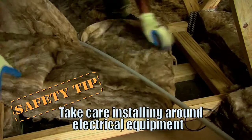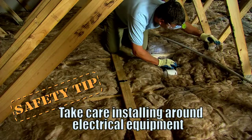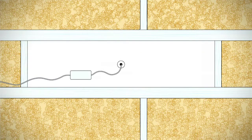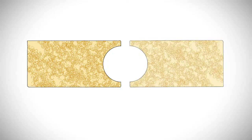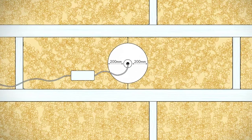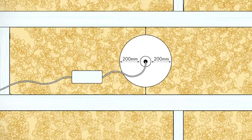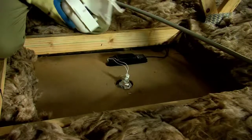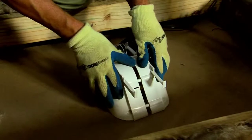You need to take a lot of care when installing earth wool around downlights, extractor fans, chimney elements and any other electrical equipment. For sealing downlights, cut a semi-circle from two end pieces and butt them together, leaving 200mm clearance from the fixture. The transformer is best placed on top of the insulation so it can disperse heat. Alternatively, you can install some plastic covers - they just clip together, place the transformer on top and then pack the insulation snugly around it.